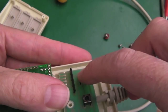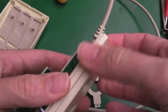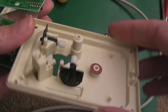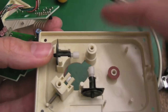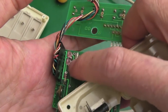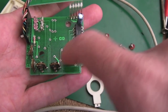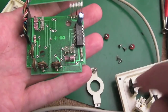You could swap those out if the buttons weren't working well. So, carefully pull those out, pull the cable relief out. You can see it's a slightly different design to other mice - you've got the wheel parts here embedded within the plastic. You can see little slots all the way around and those spin through a beam of light. You've got a transmitter and receiver pair on each side for each axis, and as that wheel rotates it continuously breaks the beam.